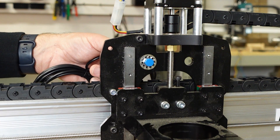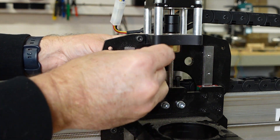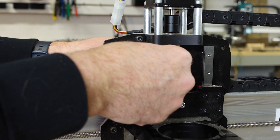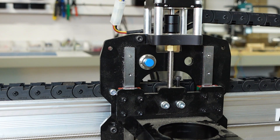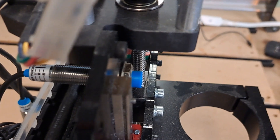Finally, install the remaining lock washer and nut. It should only be finger tight — we don't need to use tools at this stage, we'll be adjusting later on. The sensor should not be sticking out too far towards the front of the machine. We'll be making adjustments later and we want to make sure that the gantry won't crash into the sensor.